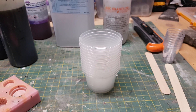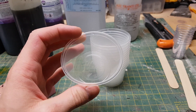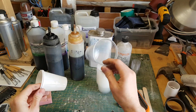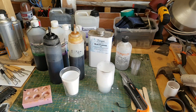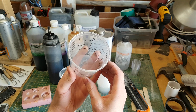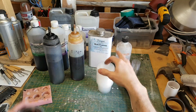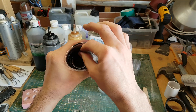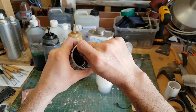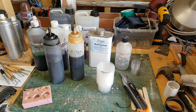You need something to actually mix your resin in, and what I've found are these condiment tubs, again from restaurant suppliers. A lot of the plastic cups from supermarkets tend to come in half-pint or pint measures, which is far more than I need for casting small pieces. You can also buy purpose-made mixing cups with measures printed on the sides, but because polyurethane resin is measured by weight I generally find the condiment tubs easier. The added advantage is that the resin doesn't actually stick to these, so once cured you can bend the cup slightly and pull the cured resin out — making them reusable.